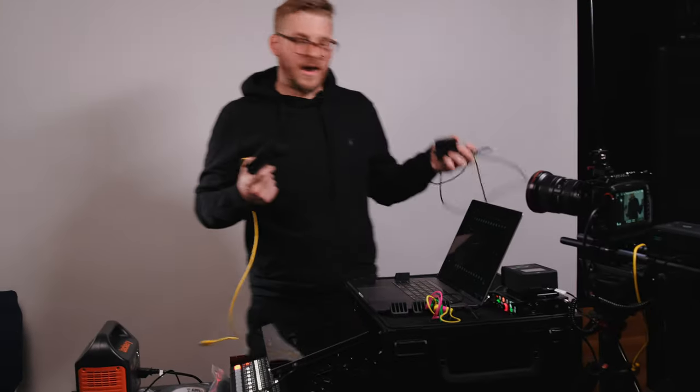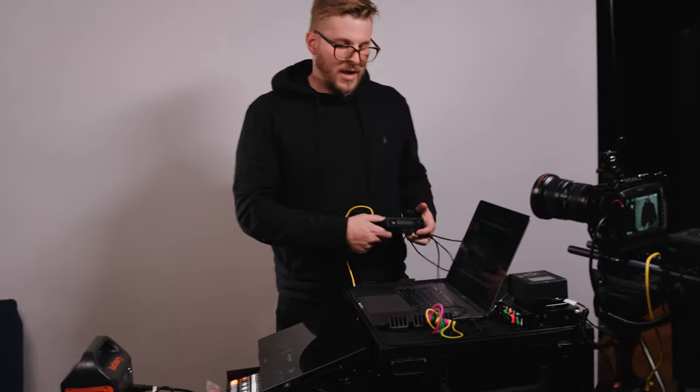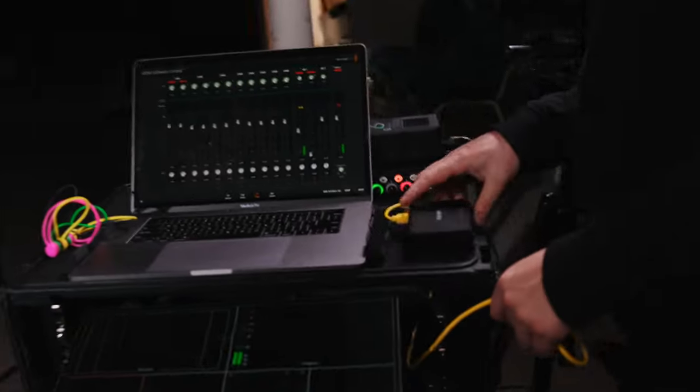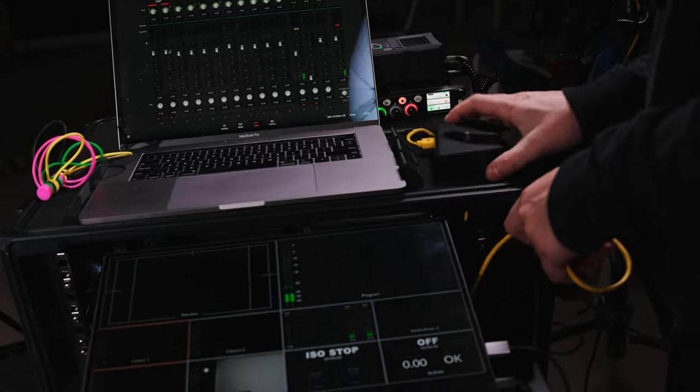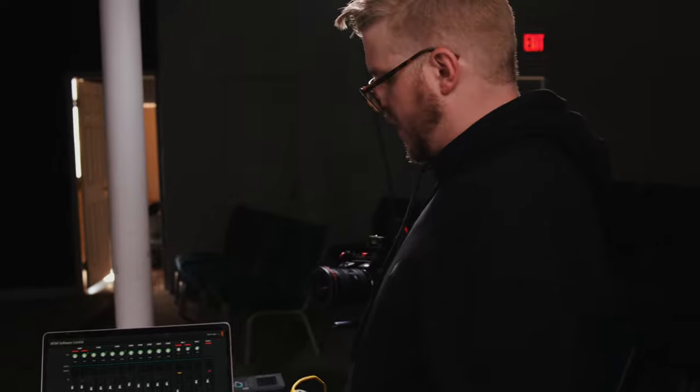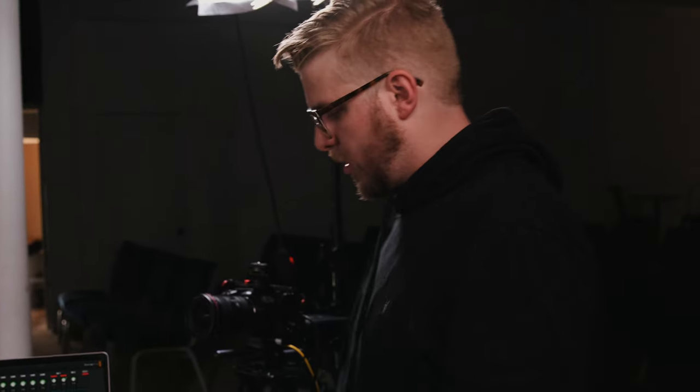So we're gonna add our VidiU X to this, and we're actually gonna be running our HDMI 2 out into this, and we're gonna run our program out into it. I want it up here because I wanna be able to change the menu. I'm a little concerned that I might need to be able to change it. With wireless stuff, oftentimes you need good line of sight and height to have a better signal. So the more you jam something into a metal box, the less likely it is to have a good signal. So I figured I'm gonna get a little higher.